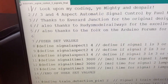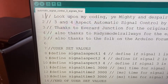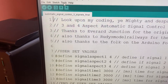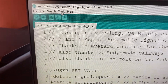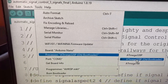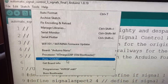Just a quick heads up: I noticed I had trouble trying to load a program onto my Arduino Nano, but I've looked up a solution and finally found one. Just in case yours doesn't upload and just carries on for two minutes then says it can't upload — what I found was: go to Tools, then go to Processor, and select the old bootloader. That seems to have solved the problem.